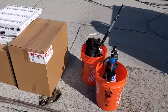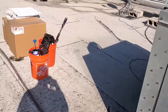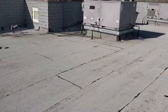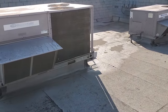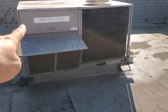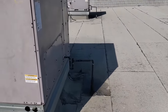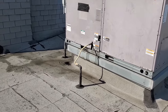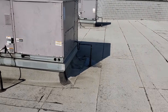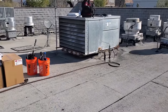We're back today. We've got boxes of filters and a ton of belts. Got another person here with me. We're going to start by rinsing. I don't think we'll even need coil cleaner for the condensers because they aren't too bad. The kitchen AC evaporator was greasy, and the one where the unit panel was laying on the ground is dirty, but everything else just needs a rinse. So we're going to rinse, adjust all the belts, change filters, and then troubleshoot through the units to see what cooling problems we might have and get them a big list.